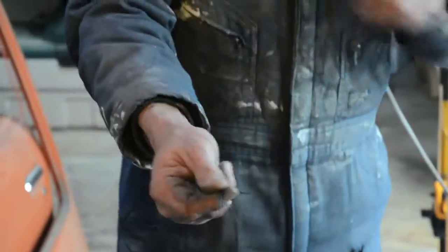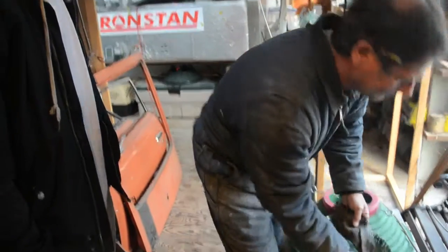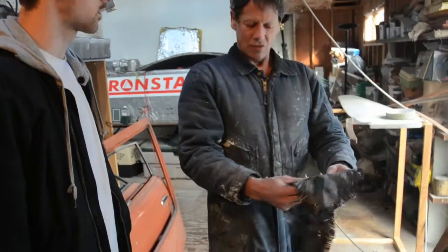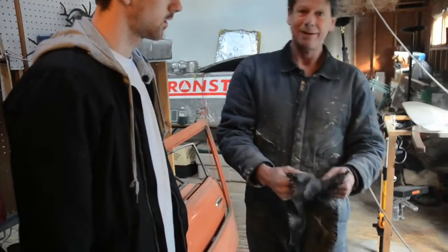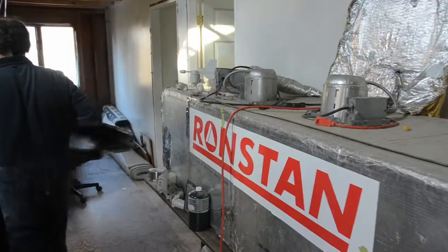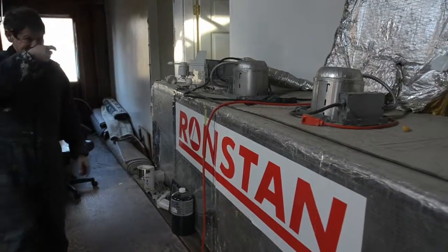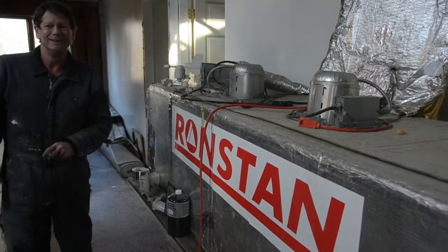Wow, it's like a magic trick. So that's why you want to make sure that you don't have dry fiber, and you have good wet layup the whole time, because the epoxy is what keeps it from touching itself. Oh, see, nobody said that about the epoxy. Yeah. Pre-preg carbon, you're supposed to have all fancy ovens. So I don't ever believe that.